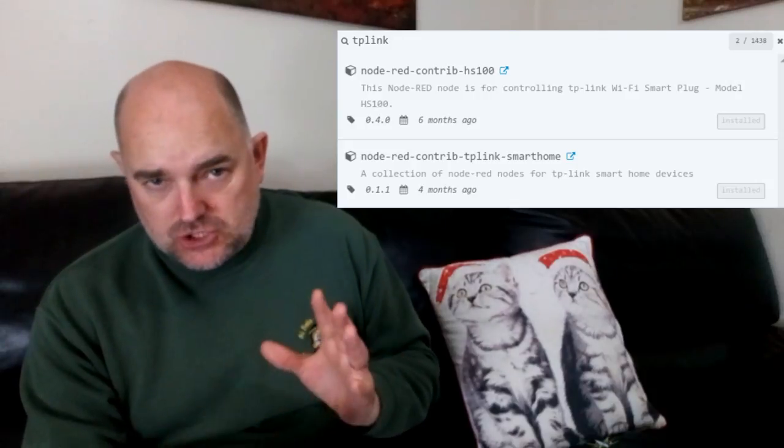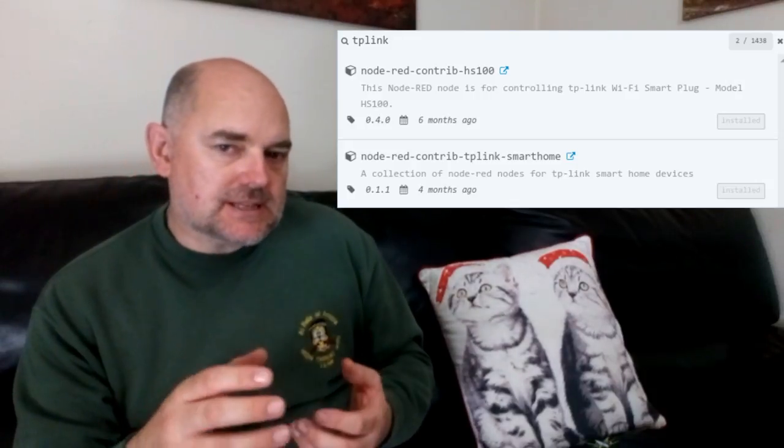The last integration I'll mention is Node-RED. If you haven't got Node-RED installed, I'll put links in the description to my playlist on how to install it. In Node-RED there are two or three dedicated TP-Link Kasa modules you can import. Once you drag them into your flow, they give you a live update under the node showing how many watts the device is using, how many amps it's drawing, and what voltage is available.